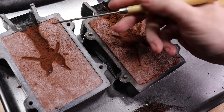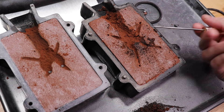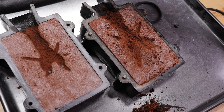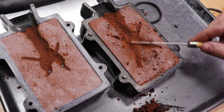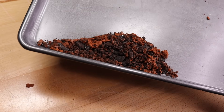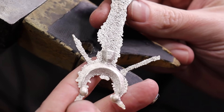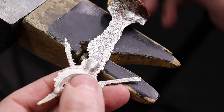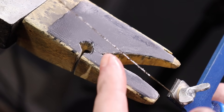Before going any further, I want to make sure to get any of the burnt bits out of the molds so I can throw all this back into my pile of Delft clay — just scrape it off. If you have a little bit in there it'll be fine. Eventually over time you're going to have to buy more of this clay, but for the most part you can use it over and over again for a long time. There's a bunch of tools you can use to clean this up. To cut this off, I'm going to be using a jeweler's saw with a size 5 blade — not 5-aught, a size 5 — and it'll make quick work of this.